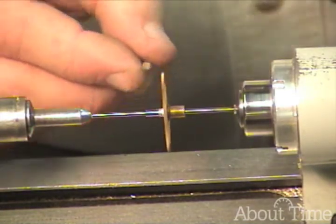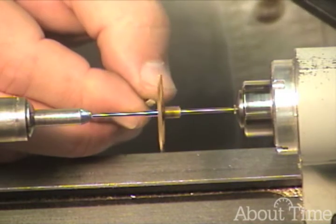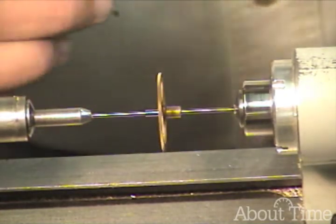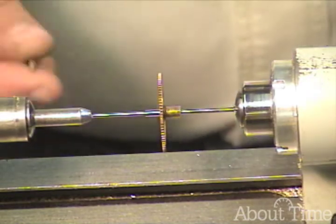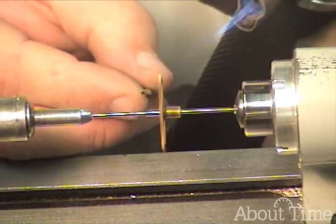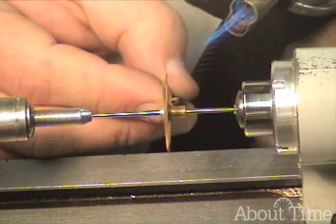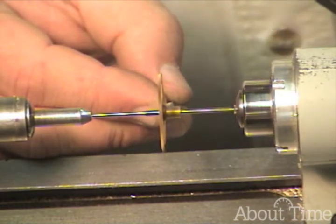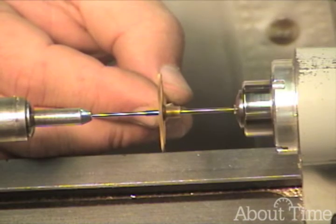The toothpick's on fire, and that'll stay fairly warm. As you can see, that's nowhere near true. One thing that I've found that helps is to increase the speed of your lathe — warm it up and increase the speed of the lathe — and then just touch it with the toothpick. And you will find a point at which this just snaps into position.